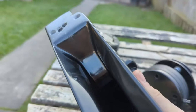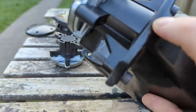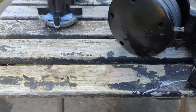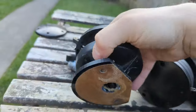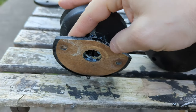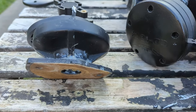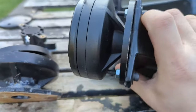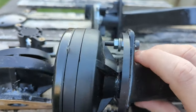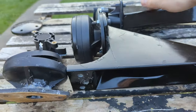It's going to be very interesting to compare these with the Celestion drivers - they fit perfectly, one-inch throat. I put a little gasket between the compression driver and the horn because the original paper gasket was very hard and aged, probably no longer sealing properly. I removed it and put a thin CCF gasket so it seals correctly.